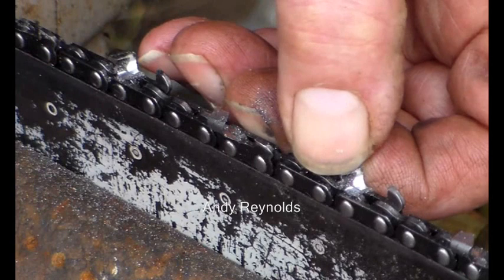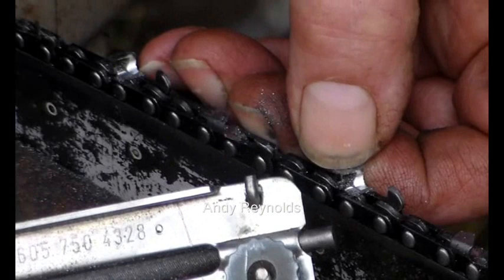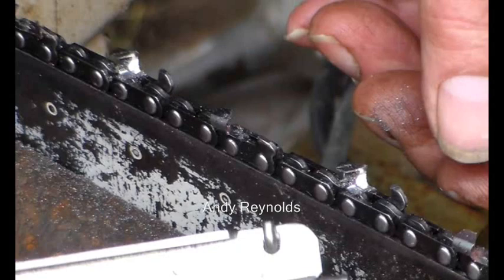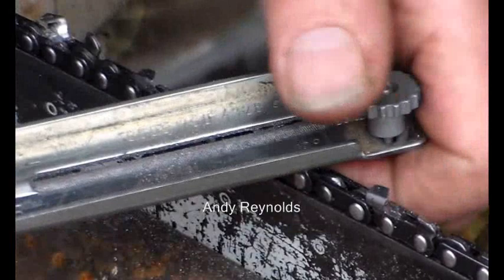Can you see that the colour of my thumbnail is changing? If you feel a burr all the way along then it's sharp, because the file has broken through the surface and has created a burr standing upwards. If you don't get the burr it's not sharp, however much you file it. So we just move to the next cutter — I can see some reflection on the end, or in fact all the way along.